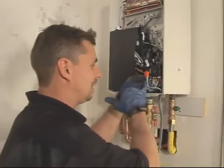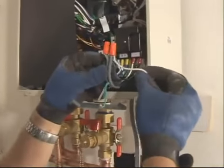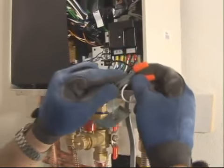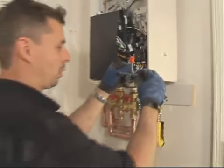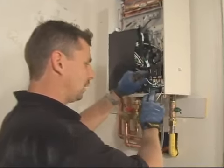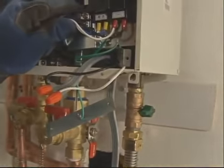As they come through, you'll have a neutral, which is usually lined with a rib side on your pigtail, corresponds with the white cord in the Noritz unit. The black is the hot, and it will be the smooth side. Of course, your middle is your ground and should be attached with a screw in the actual door. The location of the actual electrical box is in the lower right corner and is only held in by the two screws.